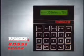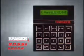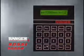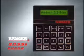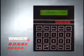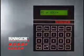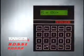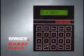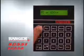Operating parameters can only be accessed by an authorized person. Entry into the operating menu is gained by entering a 6-digit passcode via the keypad. The scrolling display program stops when the first digit of the passcode is entered. After accessing the menu, if no keypad changes are made within a 5-minute period, access to the operating parameters is automatically terminated. The display reverts to the scrolling mode.